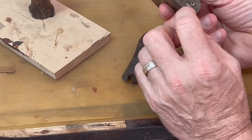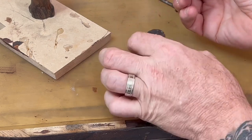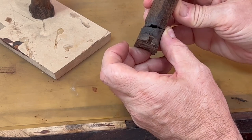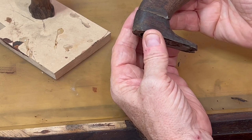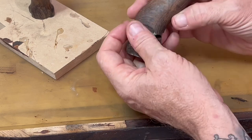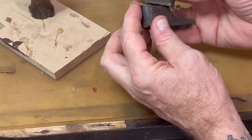Problem number two is the break. It's covered in some kind of adhesive which looks to be epoxy-like. We'll try to remove that chemically and clean up that surface. However, as I put this together, I see that we're missing a big chunk of material in the center right here in the front — we've plugged these before, not too afraid of that. And on the right-hand side, we're just flat-out missing material. We're going to have to graft something in here. We've got some arcuate grain going on, so maybe we'll cut a disc football-shaped and put that in so the grain kind of follows along.